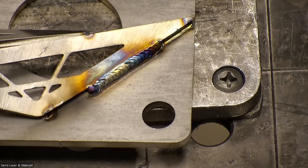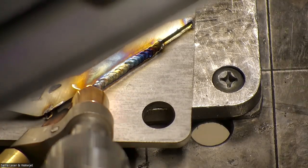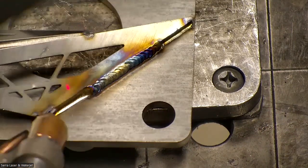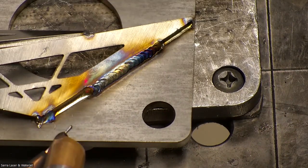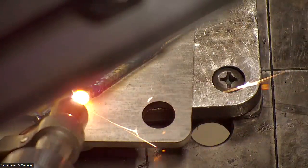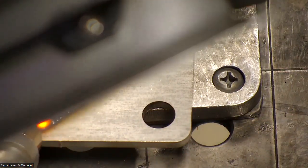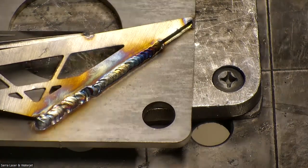Another way to do that is to increase the wobble width — I went up 50%. You can see it made it wider but it didn't quite flush it out. That may be good enough for what you're trying to do, but typically you can either do the pause or you can also go back and forth a little bit. If your gap is bigger you're going to have to build up more material — that one didn't come out beautifully but just to show you the gist.